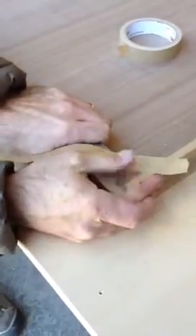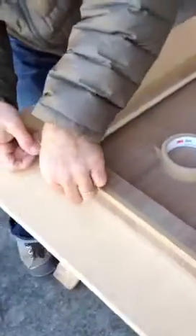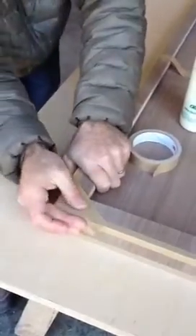He's got glue on both ends — he's going to tape that up and he's going to be done. We'll leave this in tape for maybe 30 to 45 minutes, depending on the weather. It's kind of cold today, so he might need to be in there for 45 minutes or more. You have to get the tape off as soon as possible — it's a lot easier to deal with when it's fresh than when it's sat overnight. We try not to leave this stuff in tape overnight if you can help it — get it off and detail it as soon as possible. A guy that's worth his weight in salt can detail this top in pretty good time. You can burn through the corners if you're not careful — obviously there's not a lot of veneer on the corners — but with a little bit of practice you can get this thing to look pretty darn sweet in no time at all. It's a pretty slick system.